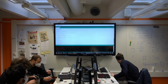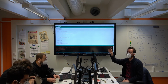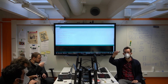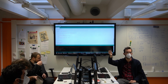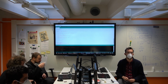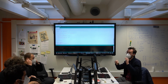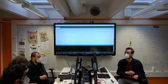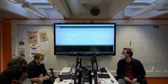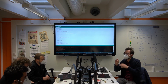I have one here. So this is a hacking USB stick. It pretends to be a keyboard, and then it types really fast nefarious commands. And there's no protection against that, because how could the computer refuse a keyboard? The only protection would be limiting the keystroke speed, so that you could not type too fast and inject scripts and stuff on your PC. But that would be frustrating for the user with a limited data rate.